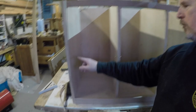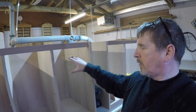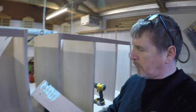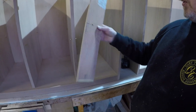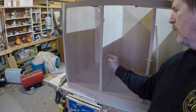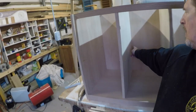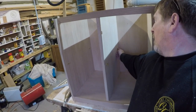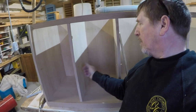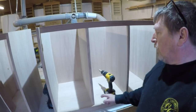Now I'm putting in these shelf supports, which are right in the middle, so that the equal distance is there, like what I said to you about the woman who has bought baskets that fit into these. So I made up a wee jig. I always make up a wee jig for this, and that's the bottom, and that's the distance from the front. I don't like to put these things too far back, not too far forward but not too far back, so that if you put weight on the front of the shelf it doesn't tip up. The same at the back, I like to have the back ones a bit more forward than this distance, in case somebody pulls it, you've got a wee bit before it collapses at the back. Drill like this one, I've not done this one yet.